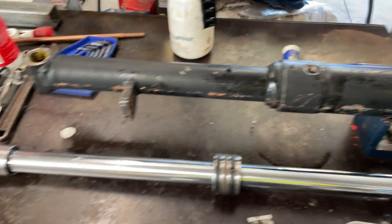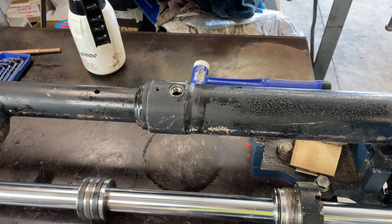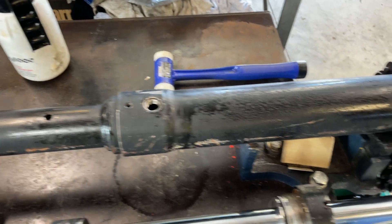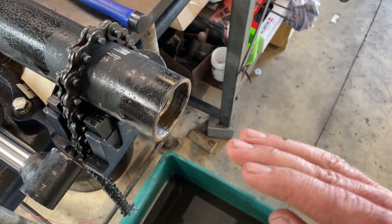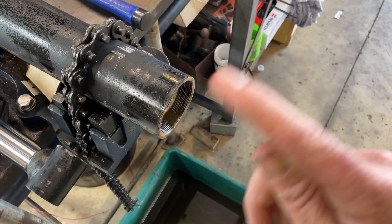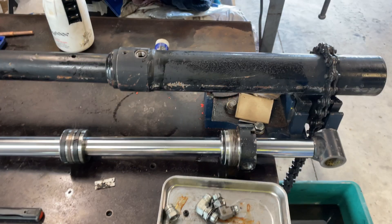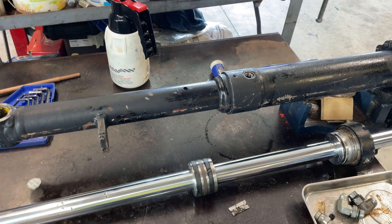Anyway, there's a tip if you get stuck trying to get your New Holland cylinder apart. It looks similar to the John Deere one but they don't have that — they've just got the internal ring. You need the bit of plastic tape that usually comes in the John Deere seal kit: knock the gland in, put the bit of plastic in, and when you draw the gland out that'll collapse the wire ring. If I get another one of those in I'll do a video on that, but yeah — if you get stuck it's usually the grub screw.